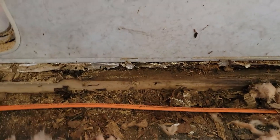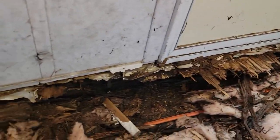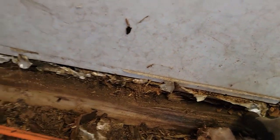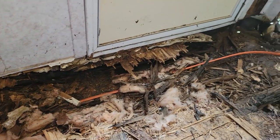This is the other side. Let's look down here by the door — underneath the board is all rotten, and it's rotten up to here. If you look, this is the plywood that was rotten, that's all shot. But it looks like I might not be too bad on the board — there's a little bit of a rotten spot on that. I might have to only go back to right about here and replace that board. The bottom of it looks pretty good, so I just need to get enough of that cut out to find out for sure what size that board is.